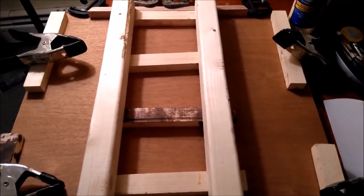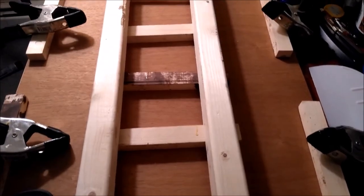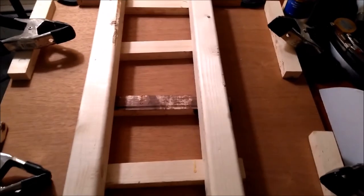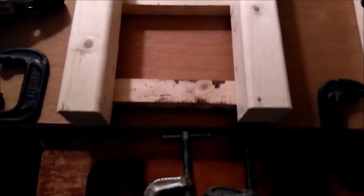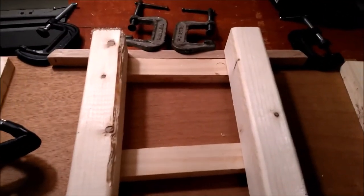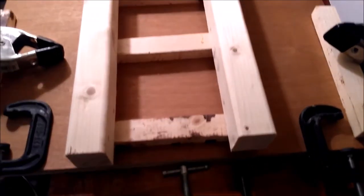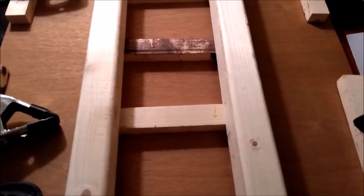Where you've got this big of a space, I'm going to be gluing very, very heavily all down underneath here between the mahogany and the plywood below with a really heavy layer. But in order to do that, you've got to be able to compress it and make sure that everything contacts. Well, that's why these rails are here. I cut these exactly the right size, and these little gluing blocks, as it were, are down here underneath them. I'm going to be using some bar clamps on each end, a total of 4 bar clamps, 2 here and 2 down here, and those together will compress the center of this down to where it's got a really good gluing contact.